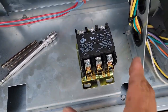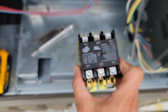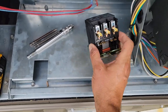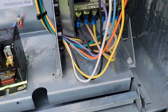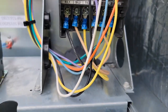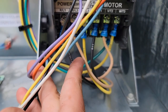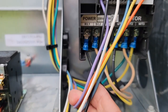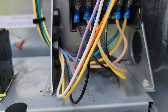Get rid of this VFD — shut the power off. Here's the three-pole contactor I'm going to use. It's got a 24-volt coil right here, so this will be where our call comes in. Take the cover off and you can see there's the power coming in for the motor — three legs — and then here is the power going to the motor — three legs. Let's get to work.